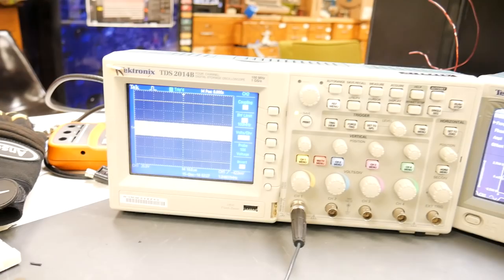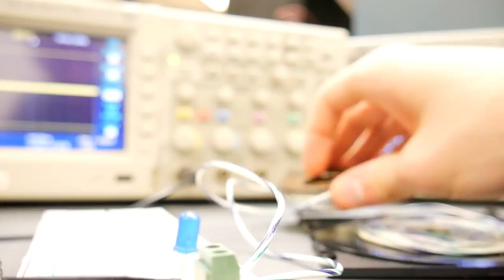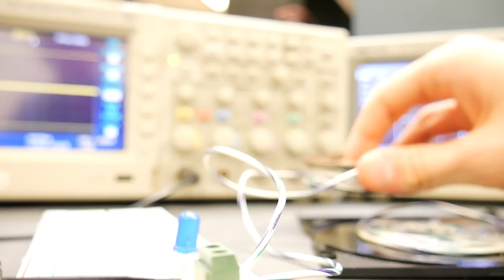But these circuits tend to be very lossy, and that's because we're probably not oscillating at the resonant frequency of the circuit. There we go. As I bring the frequency up, you can see that more power is being transferred into the output. However, it only goes so far. If I go too high in frequency, it begins dropping off again. So now I have this circuit tuned at its resonant frequency, which is about 4 to 6 megahertz,